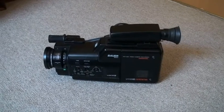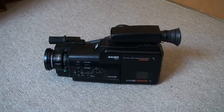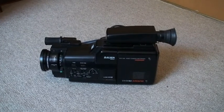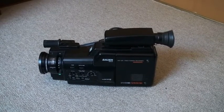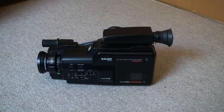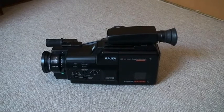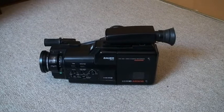Well, it's not that unbelievable if you look inside. This camcorder is probably one of the very few models that doesn't use surface mount capacitors. It uses old-school full-size electrolytics. The consequence of that is that this thing is absolutely crammed full, and the circuit boards really seem to contain nothing else but electrolytic capacitors. So it definitely made sense that they started using surface mount miniature capacitors.